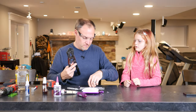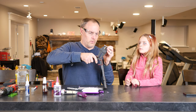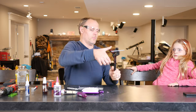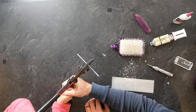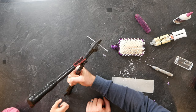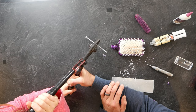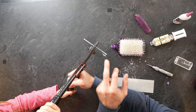Okay, good. All right, so we've got our bolt cutters and we're going to line it up right about there. You're going to cut metal with compound action. Go safety glasses on. It probably will not fly far. It's a pretty big piece. It's also not hardened, so it's probably just going to squish and fall on the table. Hardened stuff tends to snap like a candy cane. This stuff is not tempered.